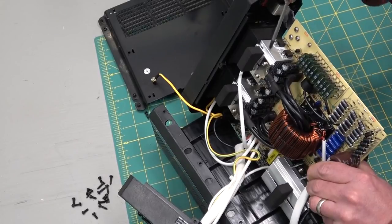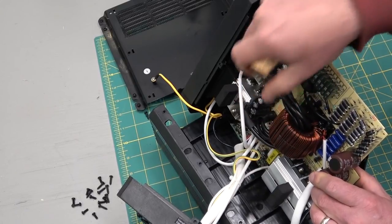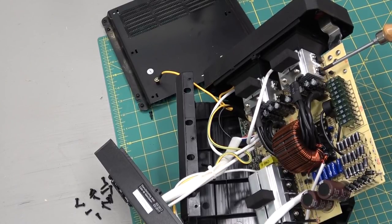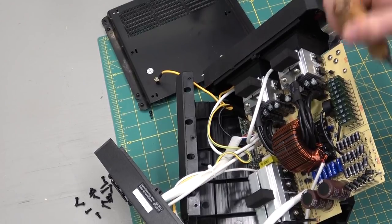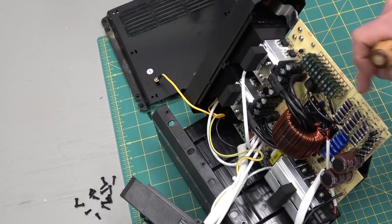We see there's fans and big old heat sinks here, and then that goes into a massive toroidal transformer. On the input transistors, we see eight of them. Instead of going with one or four big transistors, they've gone with eight smaller transistors and paralleled two of them to increase the current-carrying capability. They switched to a more common transistor to drive the cost lower, and you have all these diodes paralleled up to reduce cost. It's cheaper to get these little jelly-bean parts than to get one monolithic IC that you bolt down to the board, and there's also some more airflow in there.